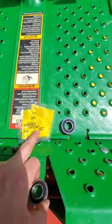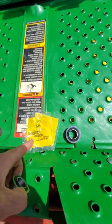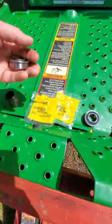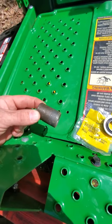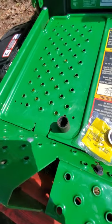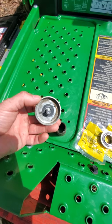Here are the parts I had to purchase. The actual John Deere part number for this bearing — each side takes two, a top and a bottom — is AM127304. Each side takes two, so if you're doing one side you'll need two; if you're doing both you'll need four. I didn't buy a new bushing — I was told I probably wouldn't need one, but I'm not sure. I kind of wish I would have. The last piece is obviously the cap and the bolt that screws right into the shaft of the yoke.